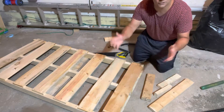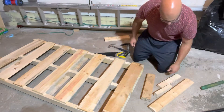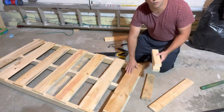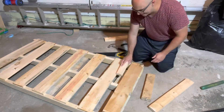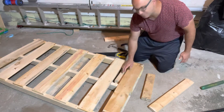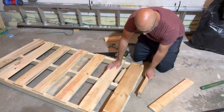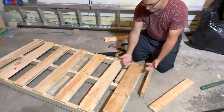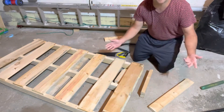Don't quote me on that because it's been a few years since I've seen it, but I've used this method many times. What we're going to do is get some short pieces of wood and put them right in between the board we're going to remove and the one next to it. They have to be short enough to fit in that little gap. I'm just using two-by-threes, and I'm going to stack two of them. Then I have an additional two-by-four that I'll stack vertically. It doesn't really matter which way you stack them as long as they are slightly raised above the ground and relatively even.